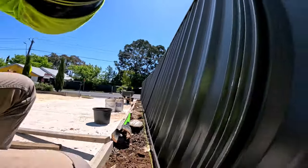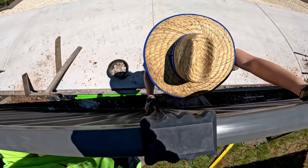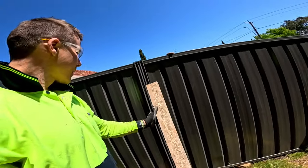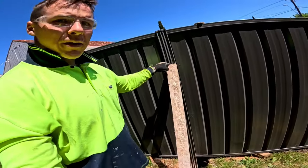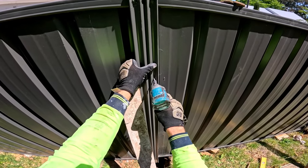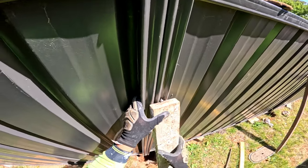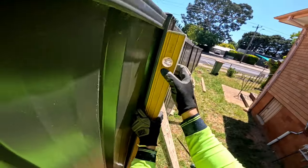As you can see, that gives us the line to follow for the bottom. Now we'll support the braces. Make sure to line the bottom of the post up first before you do the top. I'll be using this length of timber and propping it up like so. We're going to start at the bottom, but so it doesn't slide up you could clamp it here using a G-clamp, but because this is the back side I'm just going to put a screw in it. Then this will sit just under there. It's not designed to take a huge amount of weight — it's just to stop the top from tipping over. I've brought that back and it's level.